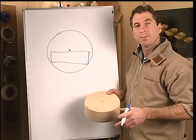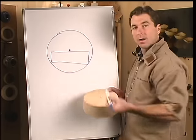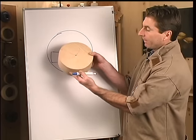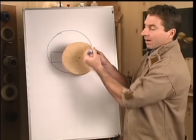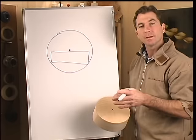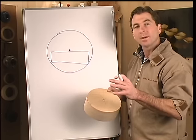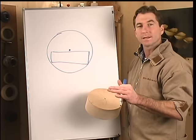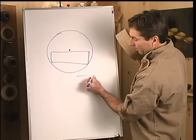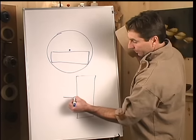Okay, let's look at our dry bowl project today. Now, this is the section of the tree our little dry bowl section came out of, just like this. If you take a look at it like that, and if you turn it over, that's the top of our bowl. It's going to be a face grain or side grain orientation. Typically, most bowls are in that orientation. Now, you can make bowls on the end grain, but typically those are for more artistic venues, and they're not very structural. So, this is the way it's going to be mounted up in between centers there, just like this.